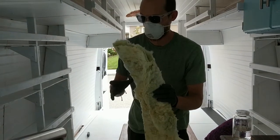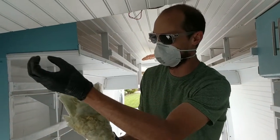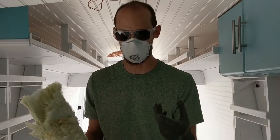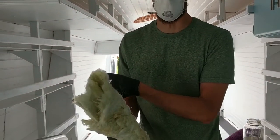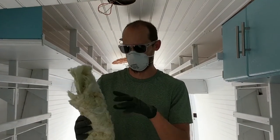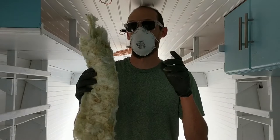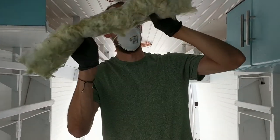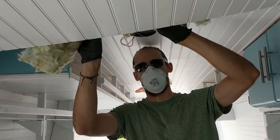We're installing Rockwool insulation near the stove. We're not sure if this is the right thing to do, but it's high temperature, and we're doing it anyway. I wanted something near the fireplace flue that wouldn't catch on fire. Polyiso, which we used for everything else, was not a good choice for several hundred degree temperatures. This is good to like 2000, but it is a lot more like fiberglass than I thought. We're a little concerned about the fibers, but we've got to put something up here.